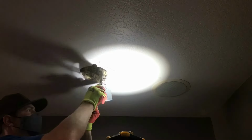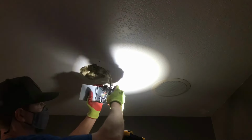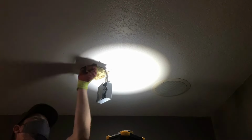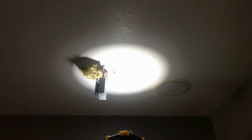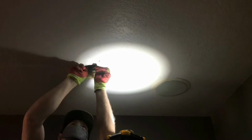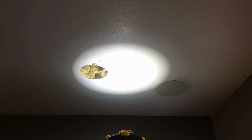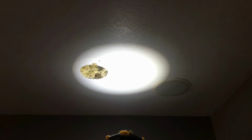Right here I'm putting the wires in the box. My wire was solid, so I just used the connectors that it came with, just pushed them in. You want to make sure that if you do use them, pull them to make sure that they are not loose and they don't come out easy. After this, I screw the box to the rafters in a spot that I liked. I would say do it at least 1 inch up from the ceiling. That way the light has enough room.